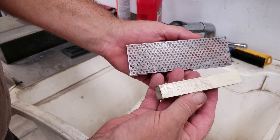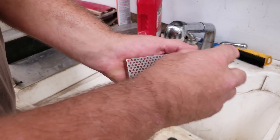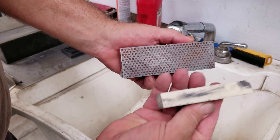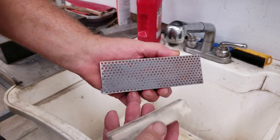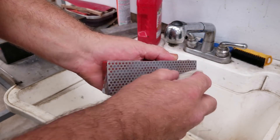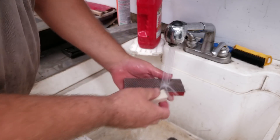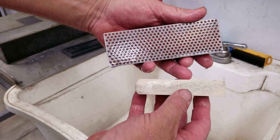I'm not getting heavy-handed with it, but there's that side of the stone. Let's take a look at this side and rub that around a little bit. If she gets oily or clogs up you'll feel it right away — it'll start to stick, otherwise it's just going to float. There's that side of the stone, so now we've got two sides clean. There's another side — I can feel a little bit of oil getting into the diamond and you can see a lot of the material getting in there, it's white with all that dirt. Then you just rinse.